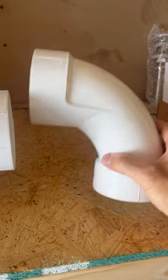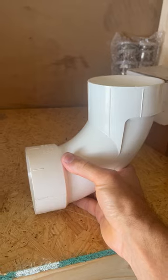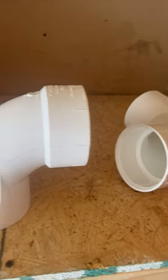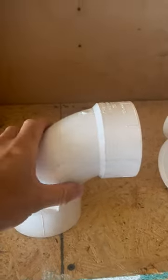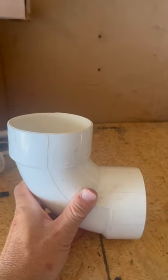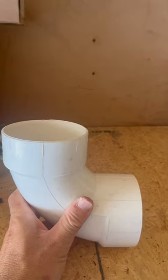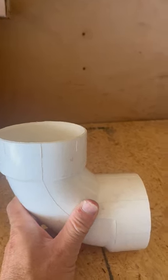The long sweep is the only one that you can lay down and go horizontal to horizontal or go from vertical to horizontal. The one exception to that rule is you can actually take a 90 under a toilet from a vertical to horizontal flow, as long as the center outlet of the drain line on the horizontal side is within 12 inches of the floor flange.